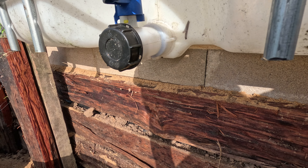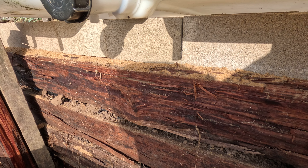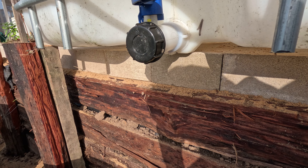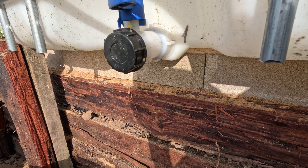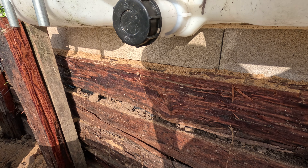This base isn't going to work because if we put the tank sideways, it's going to sit up there and all the pressure is going to be right on this point here, and it's probably going to collapse and rupture. It has to be out and fall in there. So if we do put them the other way sideways, we'll have to chip out the block so that this can seat down inside the block.